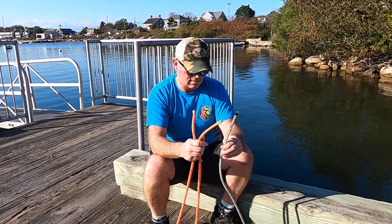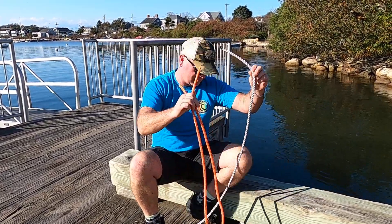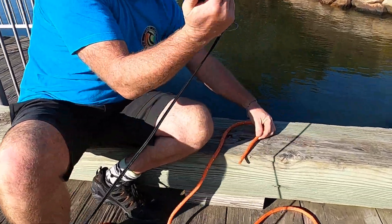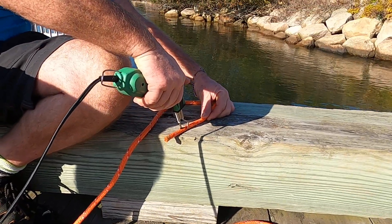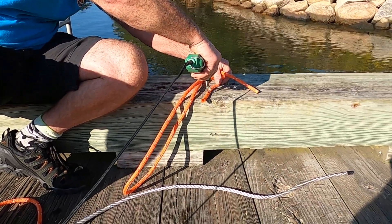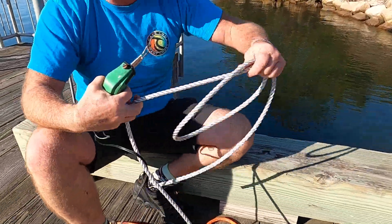It has a 1700-pound break in your vertical line every 40 feet. First thing I do is grab the sleeve, go down a few inches with my electric knife, and make a slice about an inch and a half on each end — down a couple inches on both ends.